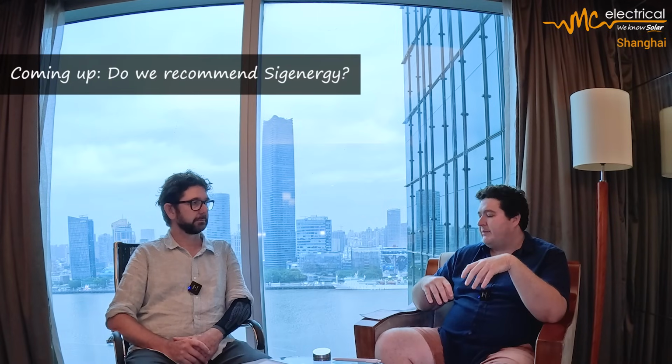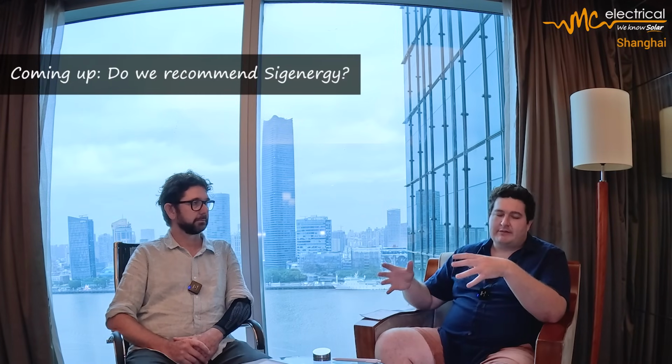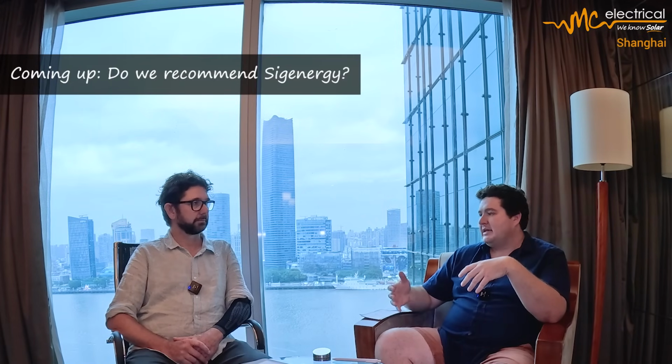Tesla's really nice. I think it's down to 4 or 5 milliseconds. You kind of see the lights flicker, but barely. Sigenergy is impressive. They talk about a zero latency backup. It's not UPS. They don't have harmonic filtering, which is what you would require for very sensitive electronics, but it's essentially UPS. Not for medical grade equipment, but it is very close.